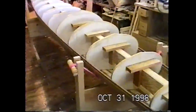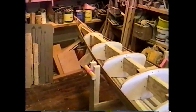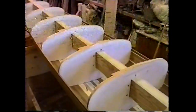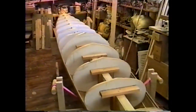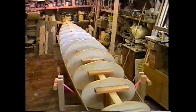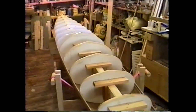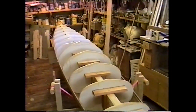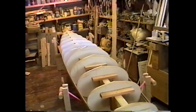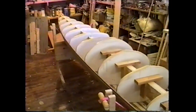I installed some webbing in my stands to hold the boat now that it's flipped over. I had to add a step compared to normal construction because I used hot glue — I had to pull the forms off the hull while the strips aren't on the top, because if I had tried to strip the deck I never would have gotten the hull out. I had to use little hardwood wedges to pop the forms out. Now I've cleaned all the hot glue out by scraping, got the forms back in, and can start with the shear strips on the deck.